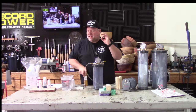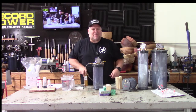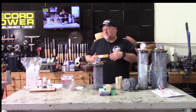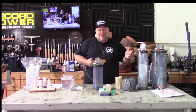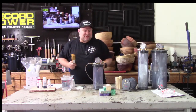And if you ever wondered how they always look so perfect, it's generally because they're stabilized, so then they can be machined and used on lapidary machines a little easier. So it can be used for a variety of things. They do have to be porous enough that air can be pulled out and resin can be pushed in, and they have to be non-oily. So if you're using a really oily wood, you don't want to stabilize it. It just won't work right.